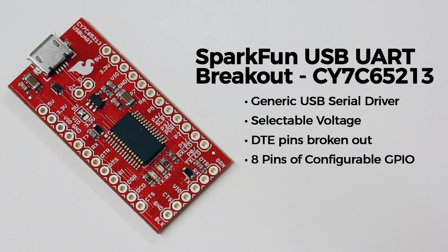Finally, this board is also capable of working at voltages below 2V. You just have to clear the solder jumper on top of the board, connect the solder jumper on the bottom of the board, and set the appropriate settings in the configuration tool.